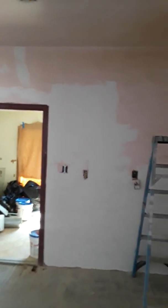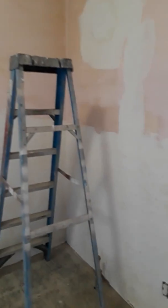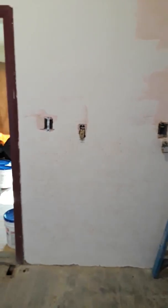Give it to Monday, we'll be back here to finish it up. Right here in the kitchen, on these walls right here, it was so terrible. We're trying to get these walls back together so that we can kilz them and paint them and get them ready so that we can get the cabinetry in. And right here on this wall, I'm going to put a GFI and a switch so that — you got to have a GFI near water and a light for a cabinet.